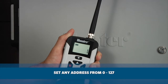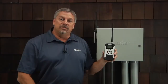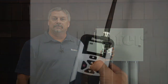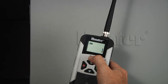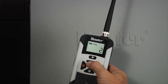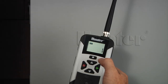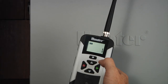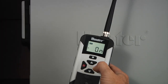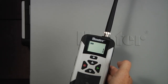You can choose any address from zero to 127. Once the new address is programmed, just let it sit idle. If you do change the address on the transmitter, you will need to let the receiver learn the new address. To change the address on the receiver, make sure that you have set the new address on the transmitter first. Here we've chosen address two. The transmitter will revert back to the home screen with address two pre-loaded. At that point, you'll plug the receiver into your controller and get four beeps, then hit the green transmit on button and get four more beeps indicating that the receiver has accepted the new address from the transmitter.